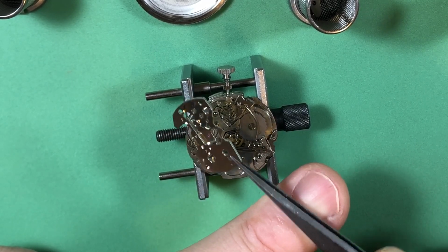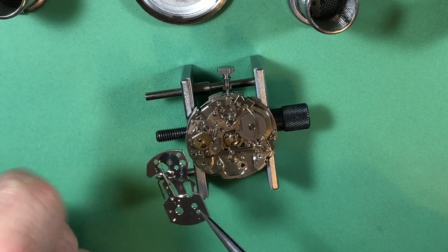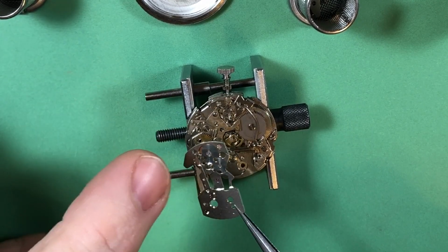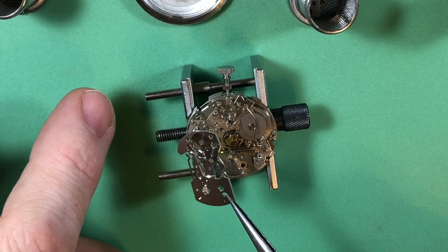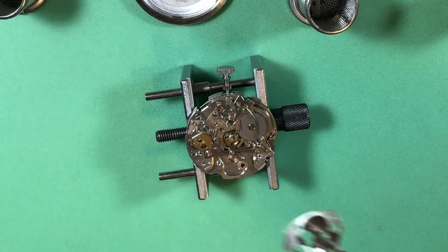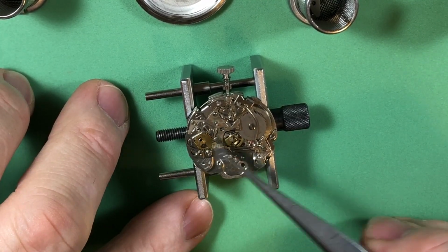Yeah, this one does not have a lot of miles on it. There's almost no deformation on this upper port right here for the minute counter wheel, because every time you reset, it gets whacked this way. Give it enough time, it'll push up a dimple of metal on this side, and this doesn't have that at all. Maybe a tiny bit. This watch head didn't have a lot of miles on it, but it also was not reset a lot.